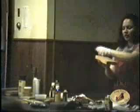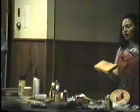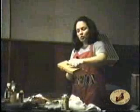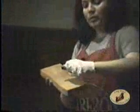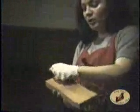And you always want to work like this. You start straight away, straight across, you make sure everything's covered. Then you're going to go in circles, and then figure eights. And again, when you get to the end, you swoop up. That's the most important thing. You just kind of do this, and I would do this 8 or 9 times, sometimes with one coat. Then you're going to let this dry, and then you're going to do this at least 3 or 4 times.